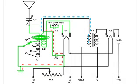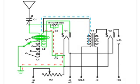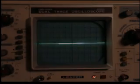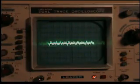V1, besides amplifying the incoming RF and the feedback, also detects the audio. We can see that at the top of L2 — the red lines show the RF at the top, and we don't want RF there, so it is drained off by the RF bypass capacitor C3. At this point we see mostly audio — pretty much just audio, with a little bit of carrier.